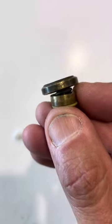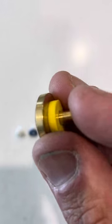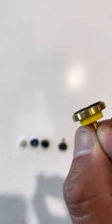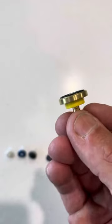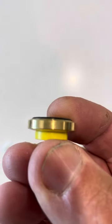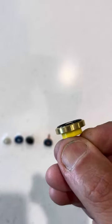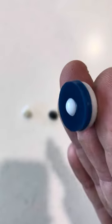With these hydro seal washers — either the anti-hammer one or just the normal one which we use a lot of — you need a really perfect seat. That housing has to be machined and you need to get all the swarf out of the pipe. These washers have a brass body and there's not much room to squeeze them tight shut, so over-tightening and wearing down of the rubber seals won't happen because you've got this O-ring seal.